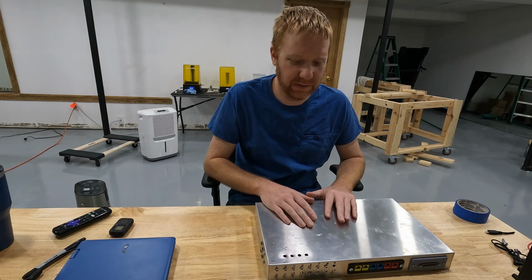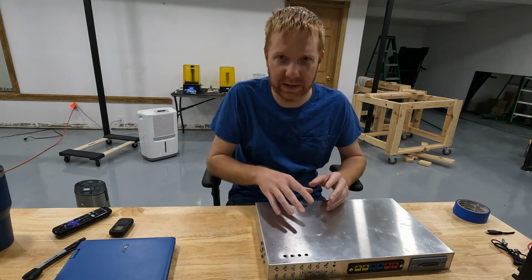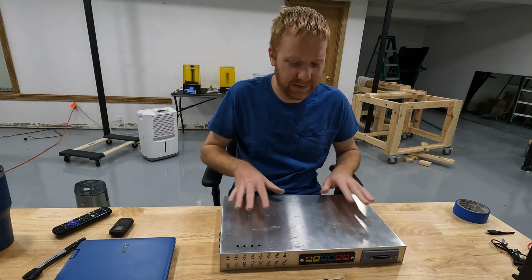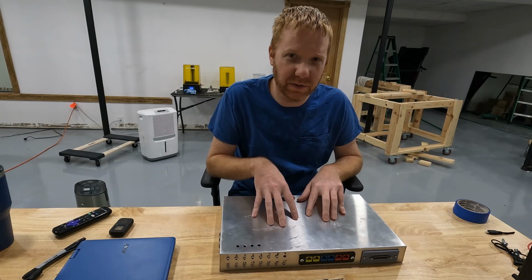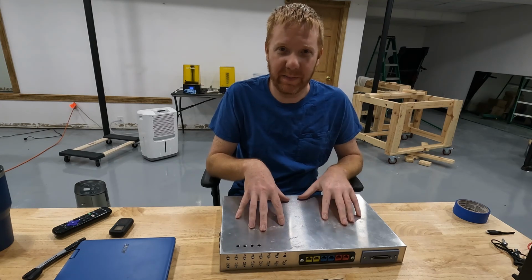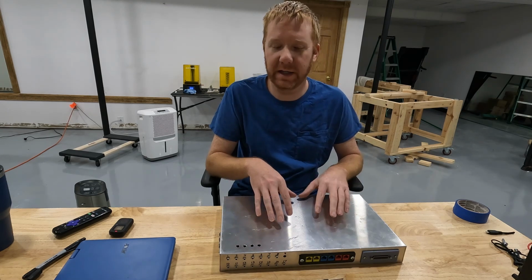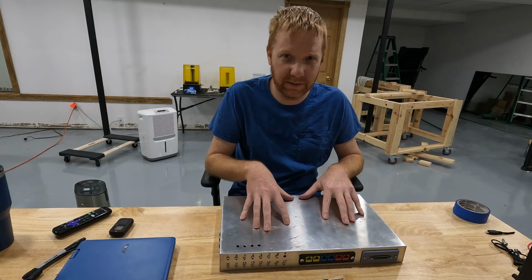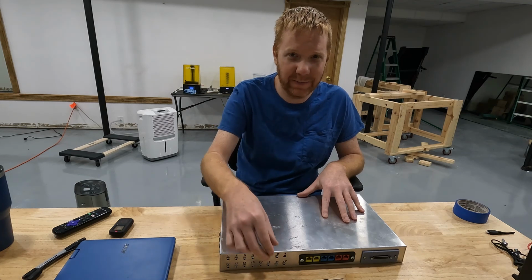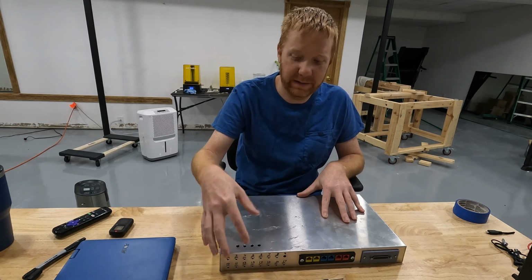The other things that I want to do is start building my own buttons and joysticks and different things that we can use to interface with this guy. Now there are some limitations, some differences between this controller and the Microsoft Adaptive Controller. From my understanding, the Microsoft Adaptive Controller allows different button mapping within software. So you can plug in your stuff and then you can map that inside the software to whatever you want. We don't have that capability here because that requires software, and there's no software inside of this box. It's very simple. You can kind of do that by unplugging buttons and plugging them into whatever button interface that you want to.